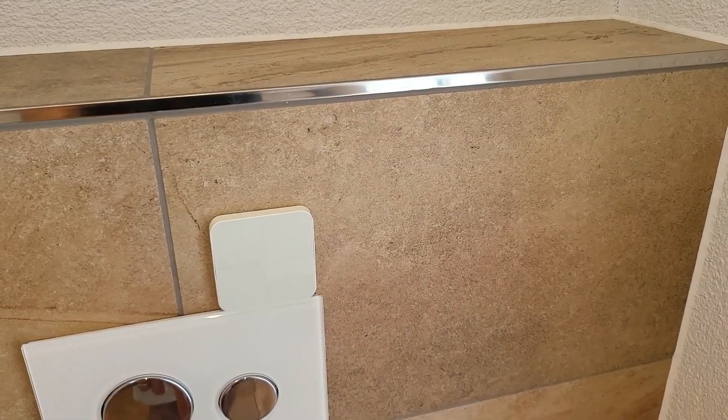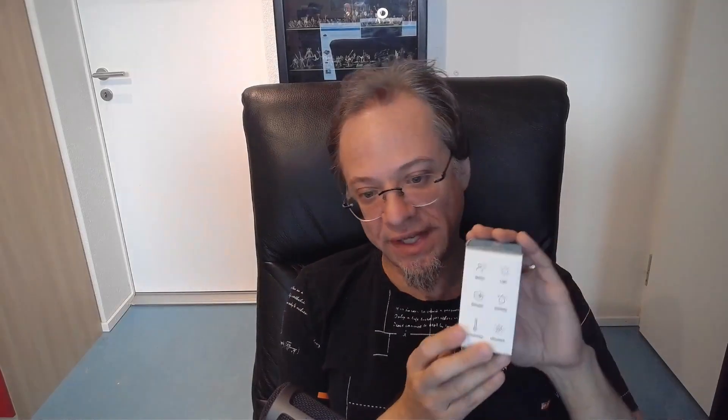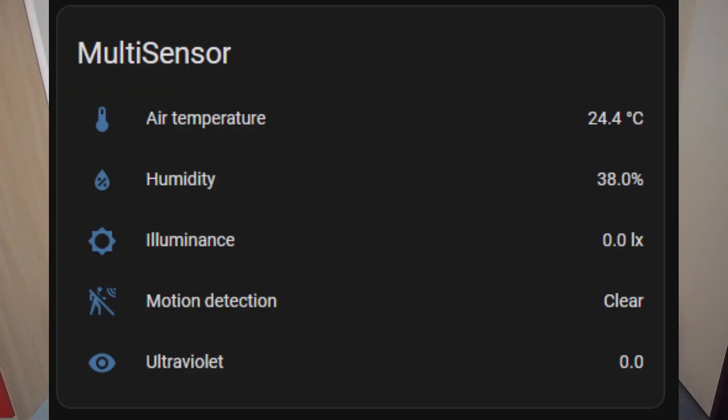I'm able to integrate the entire system with modern smart home devices. I have this Aeotec wall switch quad, a modern four-way Z-Wave wall switch — battery or USB powered — with color LED lighting, which I really love. I use these to switch my EnOcean relay box without adding any Z-Wave or Zigbee relays; I keep my old relays. I'm also able to use the Aeotec MultiSensor 6, which does motion, luminosity, vibration, humidity, temperature, and UV sensing. I use it as a motion sensor and it sends signals into Home Assistant, which I use for the entire dashboard, monitoring, and light switching automations. If you're curious how I did all of this, stay tuned for the next video.